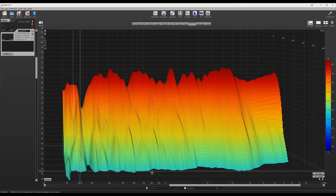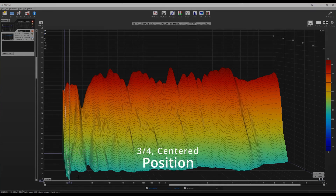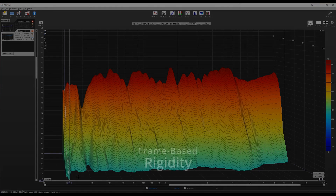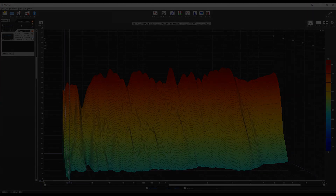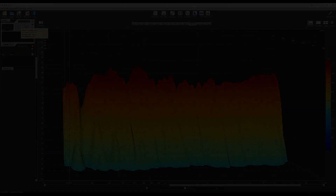So, that's it. Long story short, I'll be using a single Dayton thruster exciter for each panel and placing it in the three-quarter and centred position. I won't be using additional bracing or counterweights, but I will go for six points of frame attachment, as this combination seems to yield the best overall result. Thanks for watching — please hit me up with any questions, comments, or other feedback. And if you'd like to see where all this is going, please consider subscribing.